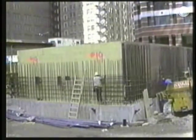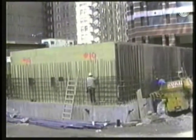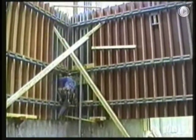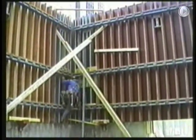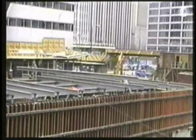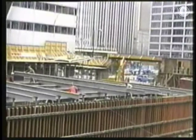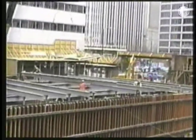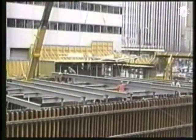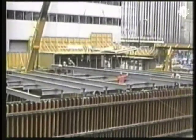Here, the interior core forms are almost completely assembled, lacking only the corners to complete. This carpenter on the form is installing the interior stripping corner. The steel I-beam superstructure is being set in place. The main carrier beams will be resting on the 60 kip jacks. These jacks can lift up to 13 feet 6 inches without being reset. All the forms will be hung from this grid of I-beams.